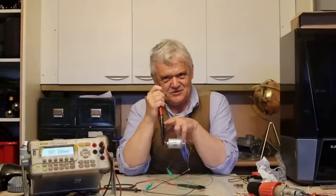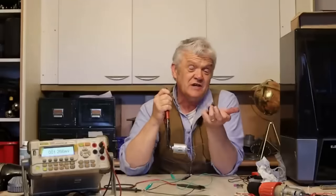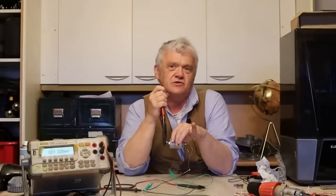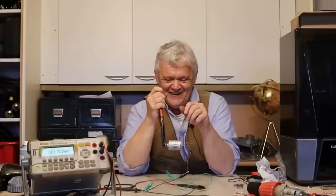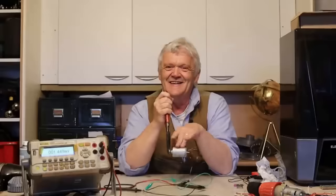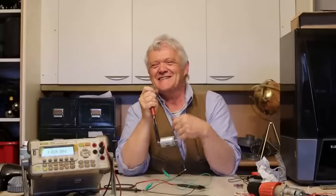Let's have a look at the voltage output. If we grip the axle and spin this body, we'll get a voltage reading. What we're expecting is something like 6 times the volts we got before — because we got about 0.2 to 0.3 volts without this adaptation, and we put in about 6 times the length of wire, so we should get more or less 6 times the voltage. Let's spin — and if Luke will do the honours and let me know what voltage we're getting... 1.3! 1.4! Piece of cake.